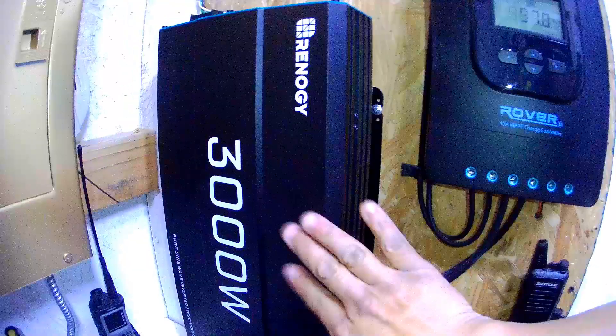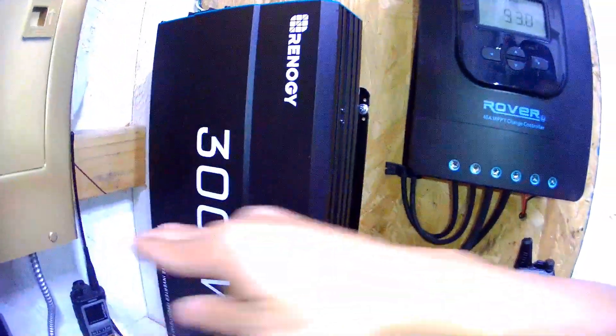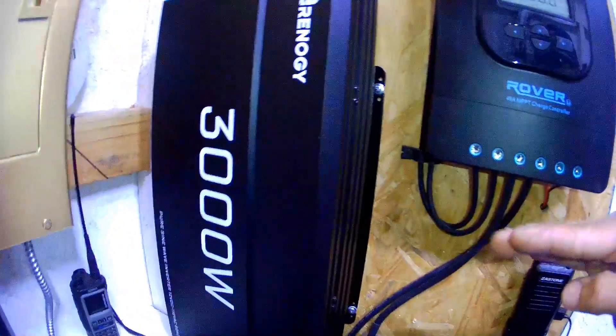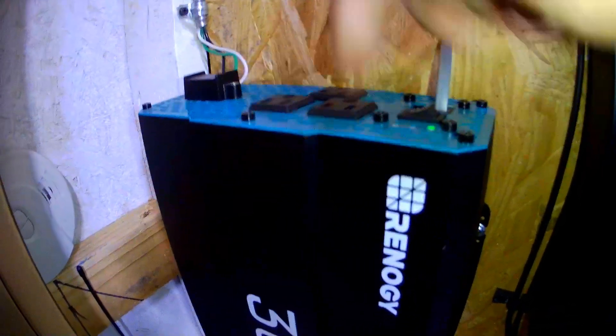The manual says you should not mount the inverter vertically like this — you have to mount it horizontal so that airflow can properly enter the fan and prevent damage. In my case I don't have a lot of debris or dust, so I'm okay with the current mounting.